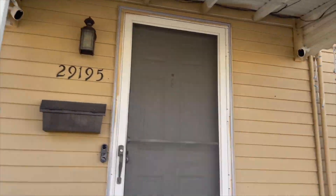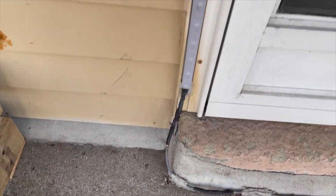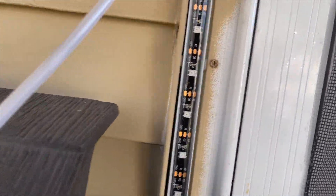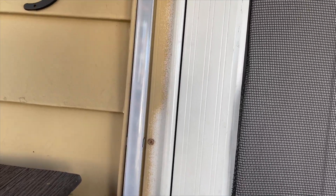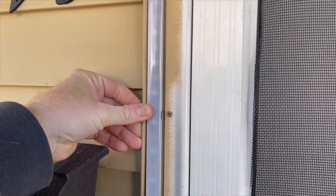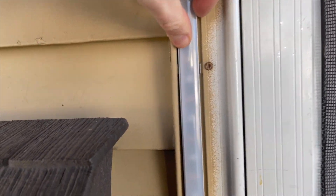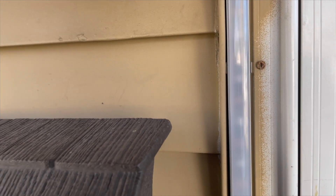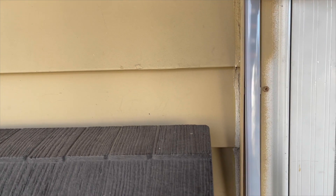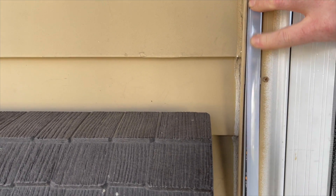We have snowflakes and strips around the door — these are the same type of strips used in the arches. I do highly recommend avoiding strips if possible: they tend to fail, break easily, and you have to be very comfortable at soldering because you'll need to cut and reconnect them with solder, making sure they're sealed and weatherproofed. You can get aluminum siding channel with a diffuser for a nice look — we ended up using the IP65 version. Over the years I've found that IP67 strips tend to fill with condensation and the circuit board or LEDs corrode.